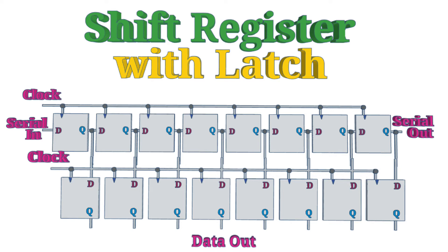This entire circuit is included in an integrated circuit such as the SN74HC595. I'll show you a real-use example: how this can be used to drive a 7-segment LED display using only 3 GPIO data pins, instead of 8 that would normally be needed. In fact, this could save even more, as the shift registers are daisy-chained using the serial output, allowing multiple displays to be connected without needing any more pins.